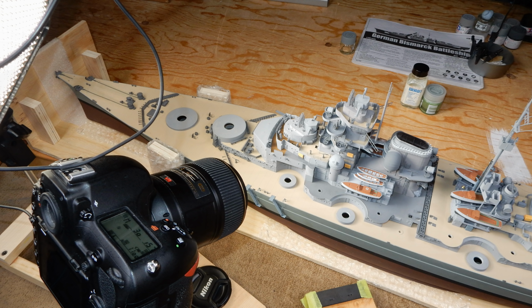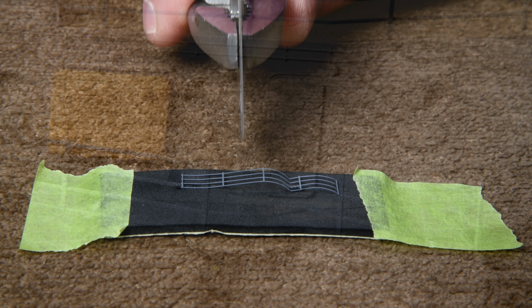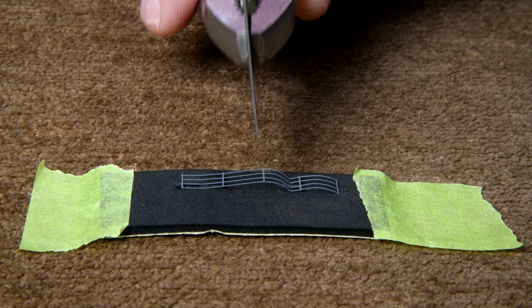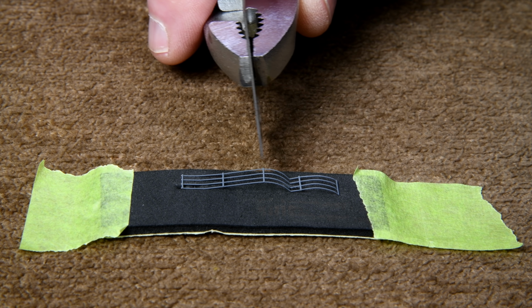At the end of yesterday's video, we were trying to determine where to make the bend. I'm guessing if we make it about 1 millimeter to the left of that post, it should be just about right. And it doesn't have to be much of a bend. Maybe only 20 degrees? Now, we want the bend to be right about there, about 1 millimeter to the left of that post. But if I push down to make the bend, I'm going to ruin the curve right there.